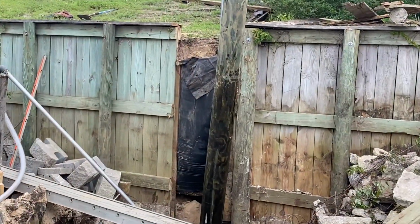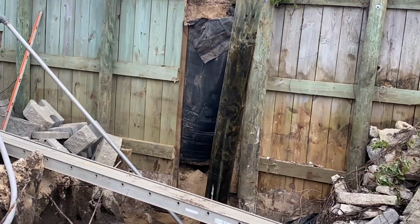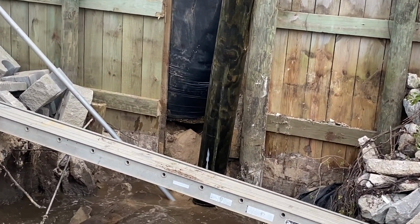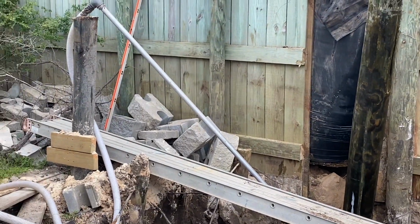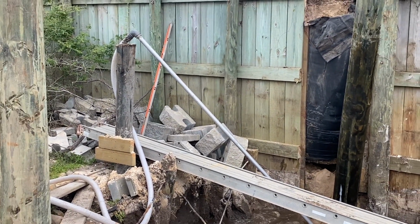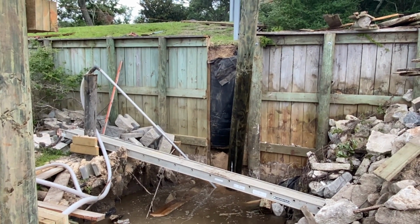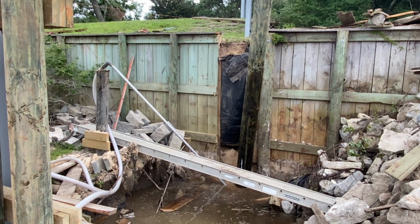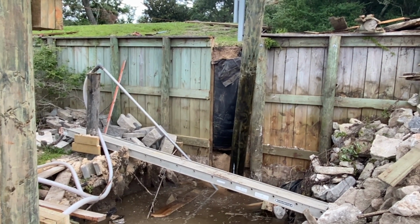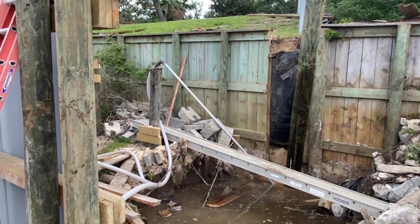You can see the erosion control block behind the wood wall is holding real well. It's holding every bit of that dirt back. And they only use 6-foot cloth. You can see there's a bottom of it right there. And they obviously had one of those old stack-in-place walls here at one time that don't work well along the shorelines, because there's no foundation. Well, there's a little foundation, but there's no foundation that goes down into the ground. And once it gets undermined, everything just caves in. So unfortunately, she's got a pretty expensive riprap in front of a wood wall.